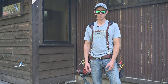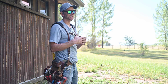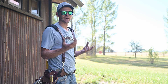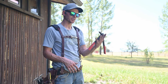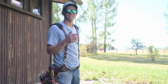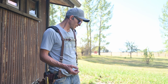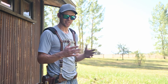One tool I got that I haven't used very much — that I thought I would use a bunch — is the M12 Milwaukee pop rivet tool. It works really good and it's a nice tool, but I found it's really heavy and awkward to carry around in your bags. It's so simple to just have a set of hand pop rivet tools. When you're doing corners and downspouts all around the house it doesn't really make sense to be packing around another battery-powered tool. A hand pop rivet tool thrown in your bags is super light — and the lighter you can keep your bags, the less worn out you are at the end of the day.